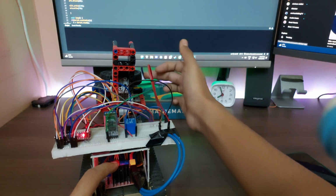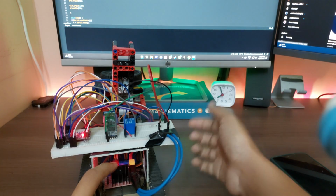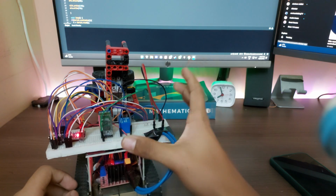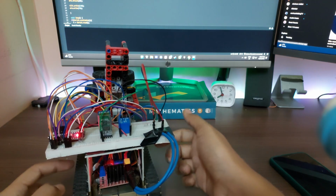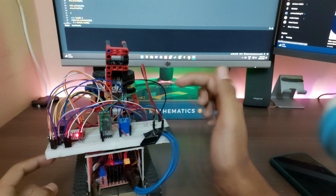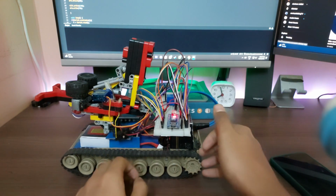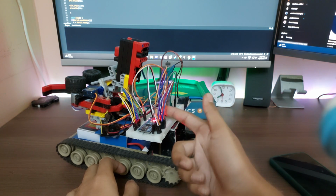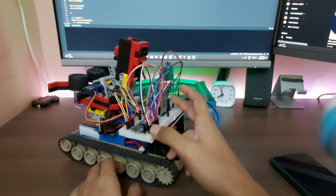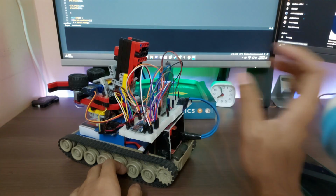This relay is controlling these two motors, by the way. This relay is obviously connected to here for power. Again, schematics down in the description. There's one ground pin going here to here because the 5 volts is coming from the L7805 5 volt output into the 5 volt input red line here on this rail. The ground is coming in, since ground has to be the same, voltage doesn't matter on ground. Over there we are powering the Arduino Nano, the HC-05, and the relays, where you have to put the 5 volt input for having the relay switch. So that's the brains of the operation.